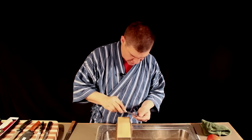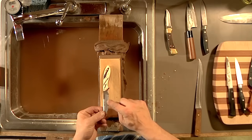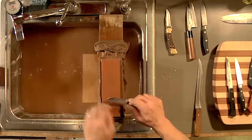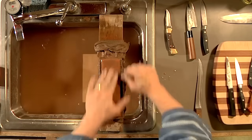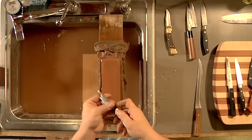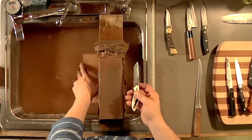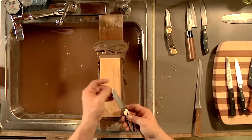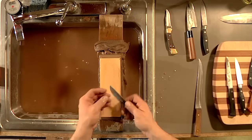Okay, it just so happens that I've got one side here that's really gray from the 1000 grit stone. In fact, I'll make sure it's completely gray. This is the secondary edge. This is step 4. Just make sure it's nice and gray, nice and thinned out. See, my neck knives start out as a hollow grind, but after 2 or 3, maybe 5 or 6 sharpenings, they become flat like that. Now, watch before and after.